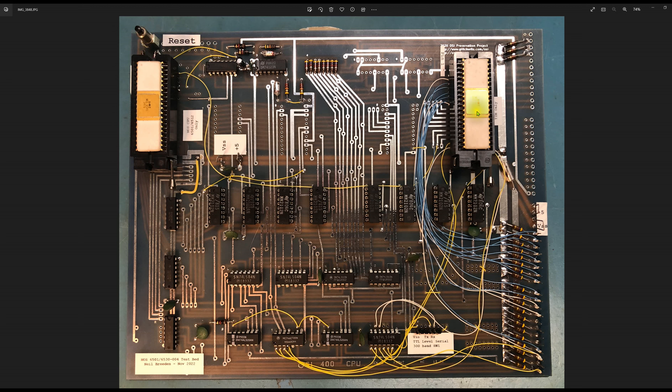The ACIA socket position is currently empty. You may notice some small strap wires — these are just pieces of wire through random holes, wrapped together on the back side to provide a little hold-down for the wire bundle so they don't fly around. I may eventually epoxy them down but haven't yet. We're not using the ACIA — I believe the TIM uses bit-banged serial via software through two bits of an IO port on the RIOT chip.